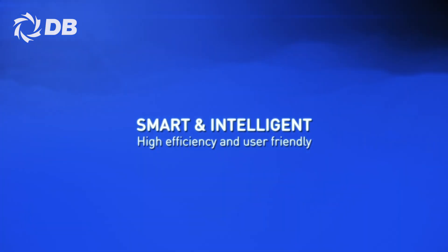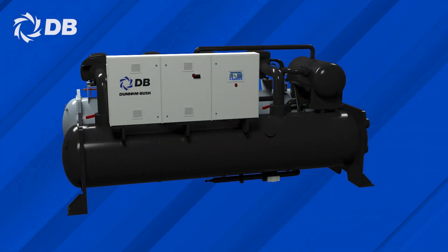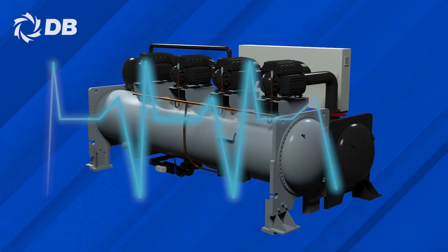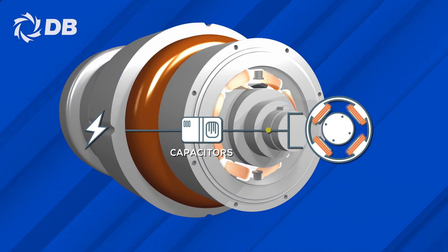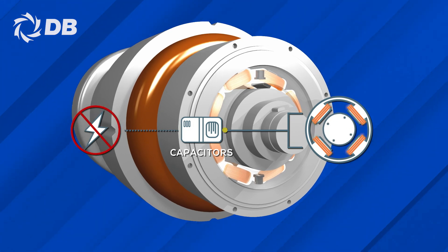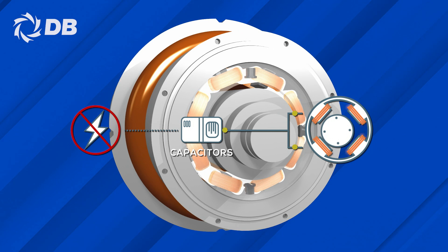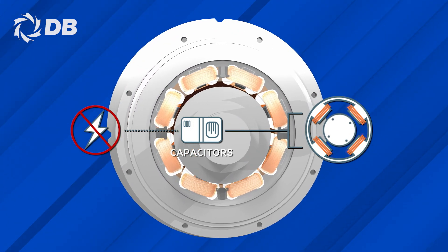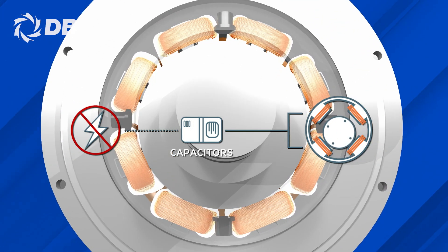With such a sophisticated controller, the DC-LCM's compressor has the capability to avoid surging by analysing the movement of the shaft against the operating map. In case of mid-operational power failure, the onboard high-rating capacitors will provide enough power to keep the rotor levitated. Concurrently, the rotational inertia of the rotor will generate extra energy to the bearing to control a safe coast down.